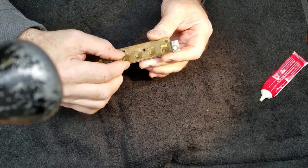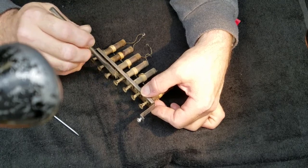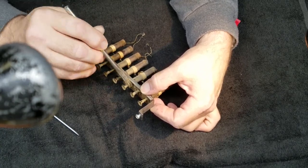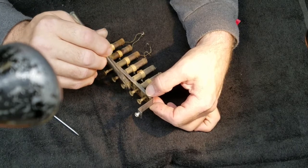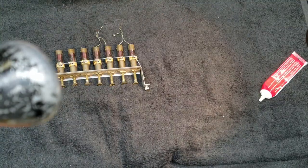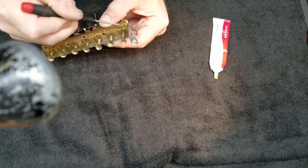3.2 ohms - so all of them have good coil continuity. There's nothing worse than getting into a radio and discovering that these little screws don't turn. Make sure I brush off - look at that dust - make sure I brush that dust off of there. You should do this if you want to clean the threads. Believe me, you'll be cussing yourself when you're putting the radio together if you haven't cleaned these threads and put a little lubricant on them, because then they're hard to turn.